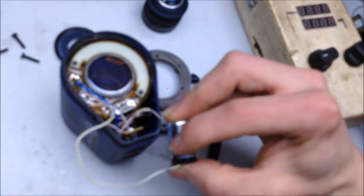Well, let's see if we can see any arc breakdown on the inside. So, turn off the light, look for some sparks. Oh yeah, I hear it. It's quite nasty. Oh yeah, you see it right in there? I don't know if you can see it right near the top, but we have breakdown right there. So, let's solve that problem.